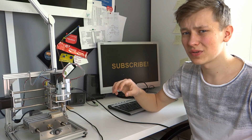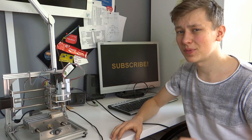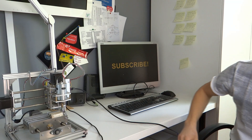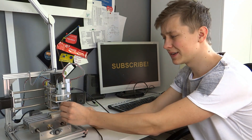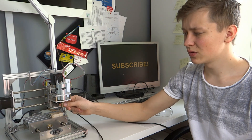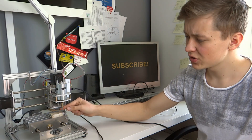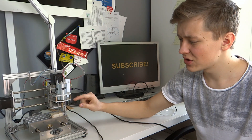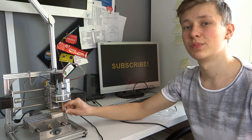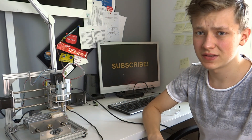There are a few things you should consider while working with this machine. This is not a toy — that's the first very important thing, because it's really dangerous. So it's really good to have safety glasses. Make sure that everything is properly connected and properly tightened, and the screws are not loose. While engraving, milling, or whatever, make sure that the bit won't touch the table or the screws that hold the component you're milling or engraving on. Also make sure that the feed rate is proper for the material you're working with.